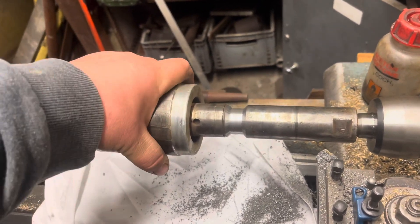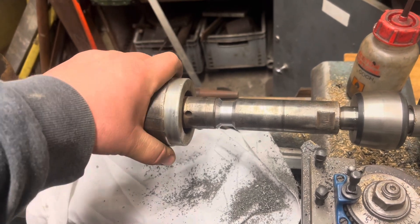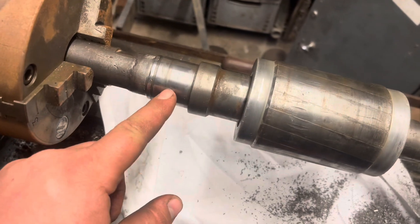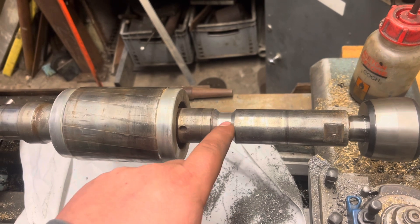I've been told this shaft has been rewound — or this rotor has been rewound along with the grinding head — three times in the last two years. So there's obviously something wrong here that's making bearings fail prematurely and damaging the seats.